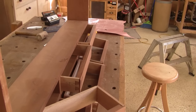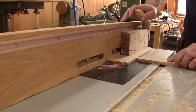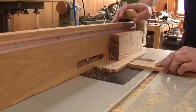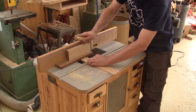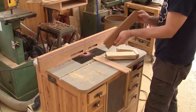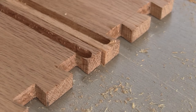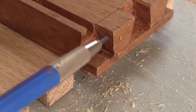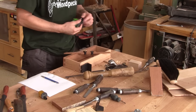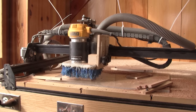Now I can cut the back dovetails. After a while, I have all the exterior of my drawers, but no bottoms. I start by cutting a groove at the bottom of each piece. I don't cut right through on the back of the side pieces, but I can for the front because of the half-blind dovetails. Now I can measure the size of the bottom, but before cutting them, I carve my logo on the drawer's side.